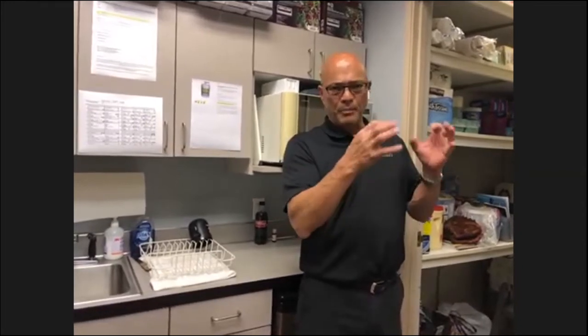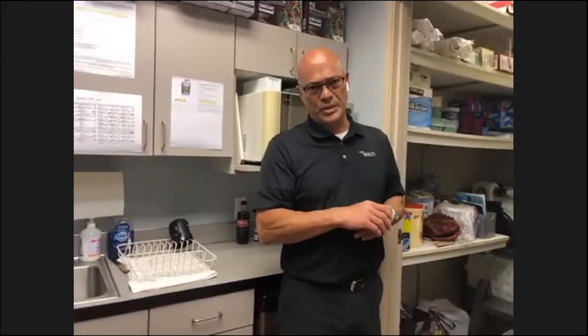But as I was saying earlier, on your amalgam separators, you have to do a visual check on that cartridge. If your cartridge is really dirty and a lot of bio growth is going there, I've had it where you cannot see how full that cartridge is. So that's another thing. It keeps that clear.